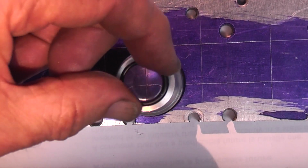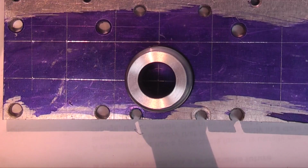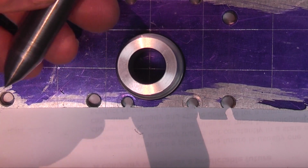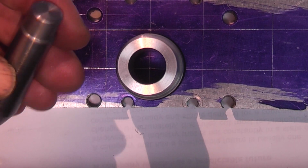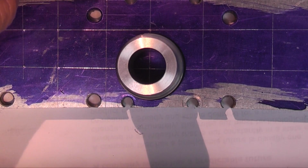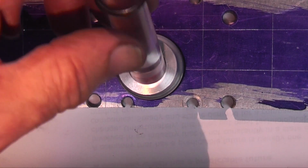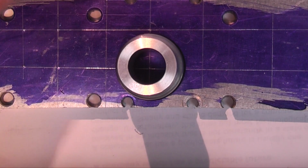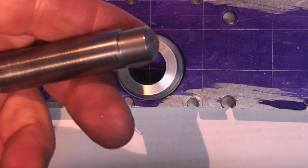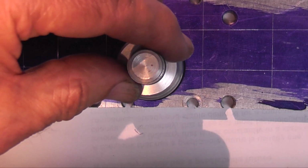The centre punch, obviously, whatever size hole you make, you have to make the centre punch bigger. So this is my centre punch for this. It's just under 15mm. In fact, that's the thing I should point out. Be careful with the Perspex rods because although they say they're 15mm, it comes out to under 15mm. So if you drill and ream a hole for the 15mm and you're not machining the Perspex, you will find the hole's too big. So you have to take the material for your centre punch and machine it down to make sure it's a good fit in the finder.